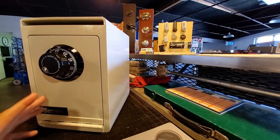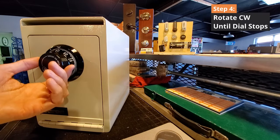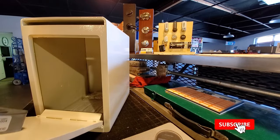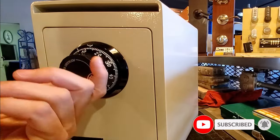But we're not done yet. Even though we've dialed in the three-digit combination, there's one more thing we need to do: turn the dial back clockwise until it stops on its own. That is actually retracting the bolt. Check out the video on how combination locks work to see why. Once it stops, the bolt is retracted and the safe can be opened.